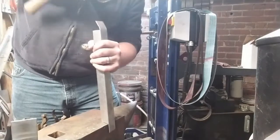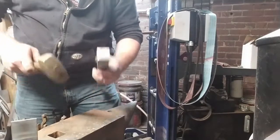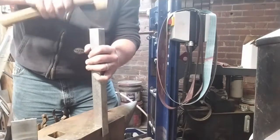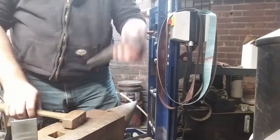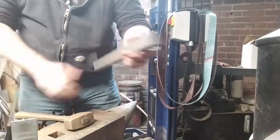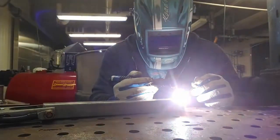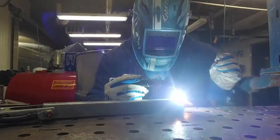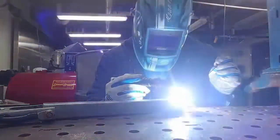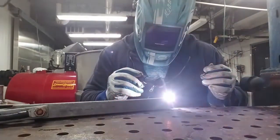Now, this is the same kind of vessel that you would make if you were making canister Damascus, and a lot of makers will cut a plug instead of folding the edge over. It doesn't really make a difference. I always thought that the process of cutting a plug was a lot more cutting and fitting, but it welded up really nice. Ordinarily I would use a MIG for this, but the MIG machine was in a different area of the shop, so I was stuck with the TIG. And here, when the metal is all clean, it welded up beautifully, even though I was just using a piece of baling wire as my filler material.